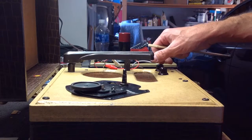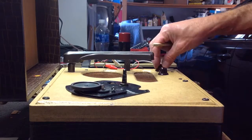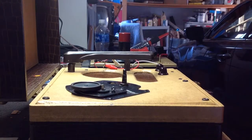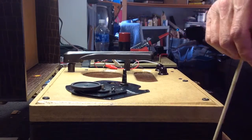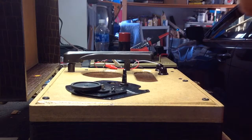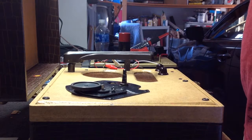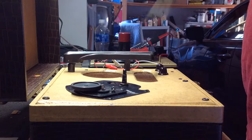It's not bad. Let me turn that down for a second. So this RCA player back here has one of those Chuo Denshi cartridges in it, and those are really puny. I don't even know if they're half a volt. They're like 0.35 or something. I'd have to look that up, but I'm pretty sure it's less than half a volt, whatever it is.